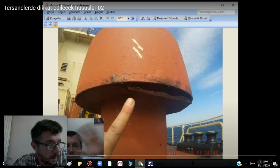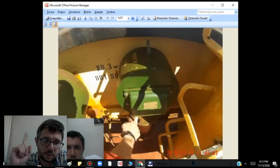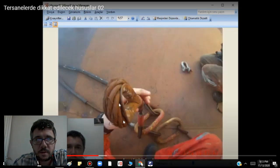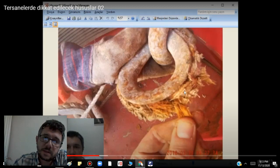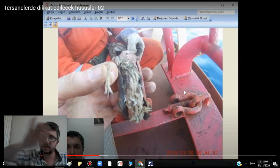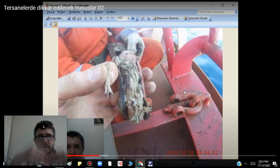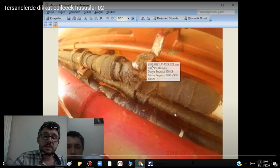I am telling all of them, but most probably most of them they will not make in the shipyard. Your company will tell you to make on the vessel. But don't forget, as much as possible, try to push them to the shipyard. This is mushroom ventilation — mushroom ventilation is one important point. When you turn the wheel or sometimes it is with the flap, there is a flap like this inside. Sometimes the wheel is turning but inside the disc is not closing, or the flap is not turning. Or sometimes the disc or the flap inside is already very rusty — you are closing but it is not closed ventilation. You have to check this one if any problem — this is a big job you can make in the shipyard.